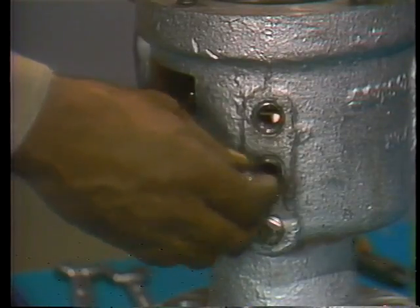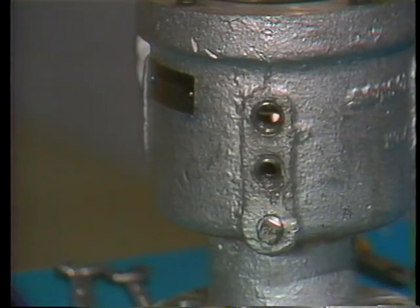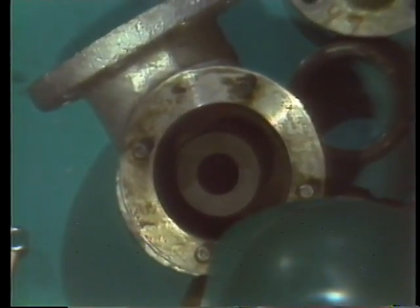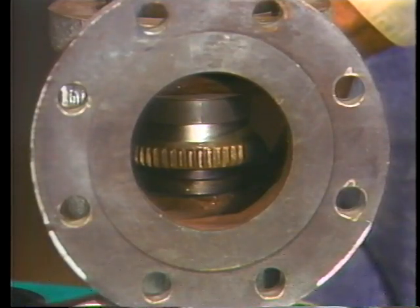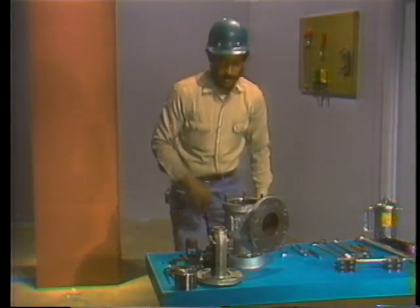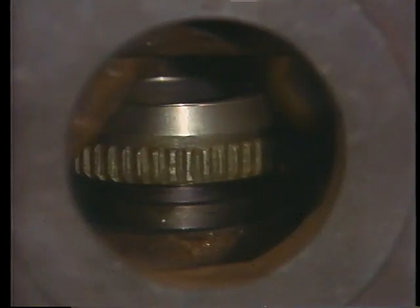This frees the lower ring so that it can be turned. The mechanic uses a screwdriver to reach into the valve body through the lower locking pin hole. Looking through the top of the valve, we can see he's using the screwdriver to turn the lower ring. He carefully counts the number of notches that move past the pin hole as the ring turns. When the lower ring touches the lapping block, he stops and immediately writes down the number of notches counted — in this case, 10.